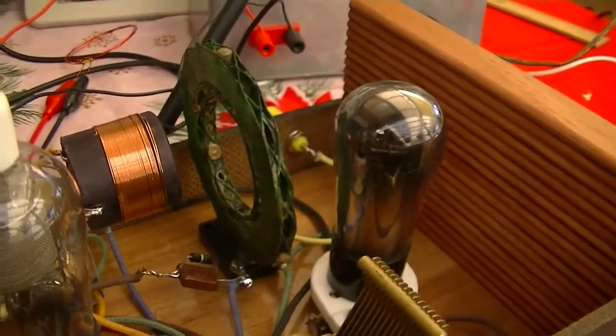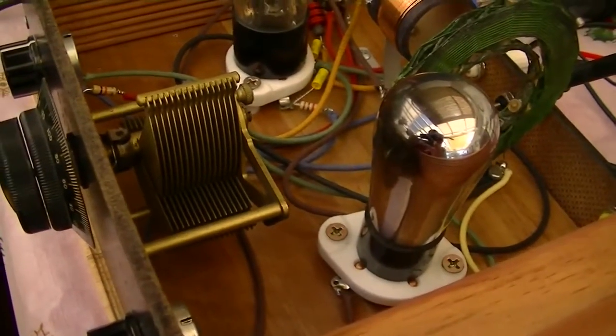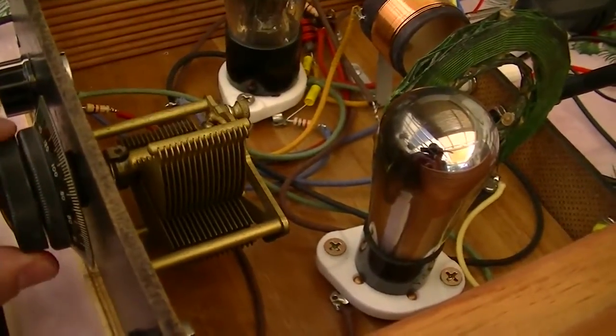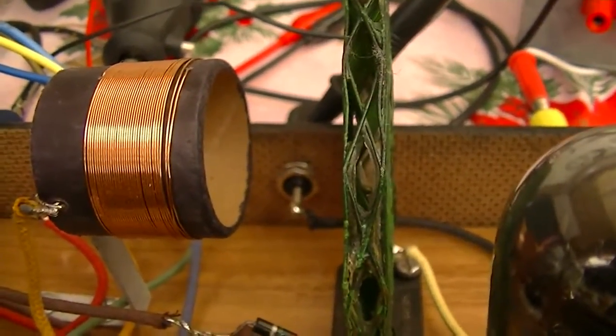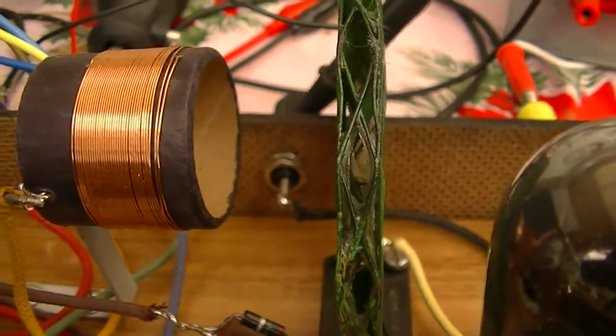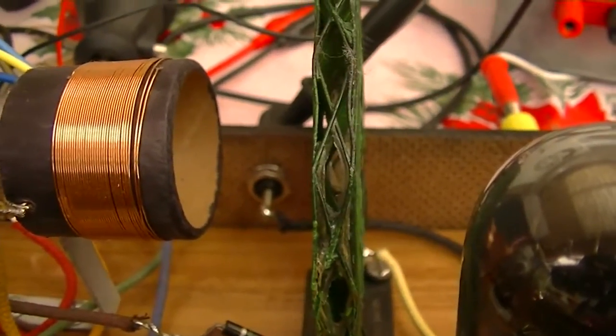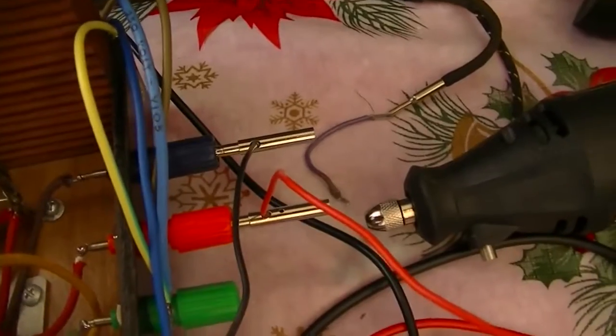There's this green coil over here, which I found — it's from a mid-1920s TRF radio, got it for about 20 bucks. The tuning capacitor has a built-in reduction vernier drive, probably from the late 20s or early 30s, made by a British company called Ormond. Valve bases are ceramic types bought from China. The regeneration coil is just a bit of cardboard tubing wound with enamel-coated copper wire and painted black to look antique. The binding posts are cheap plastic ones from Jaycar, about a buck each.